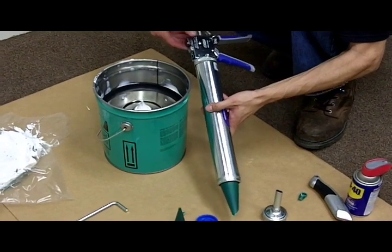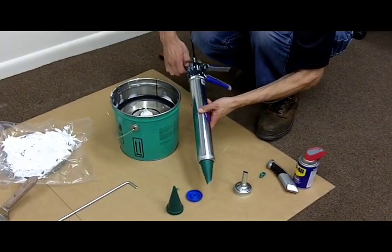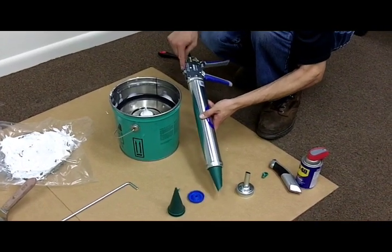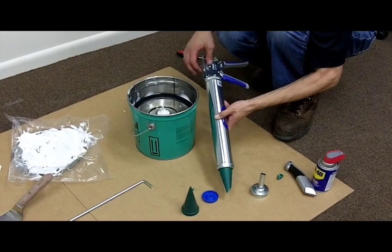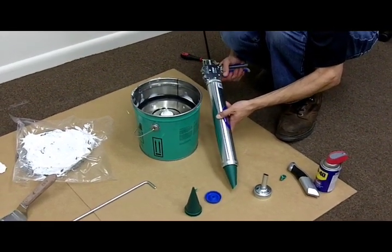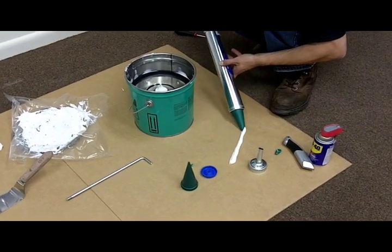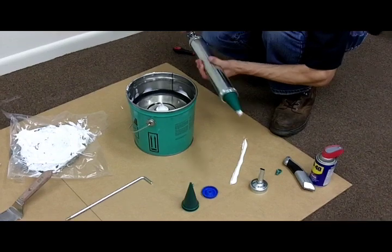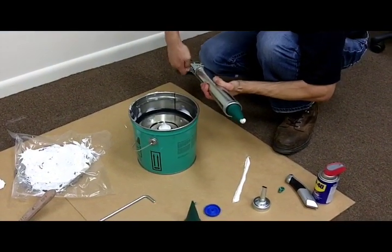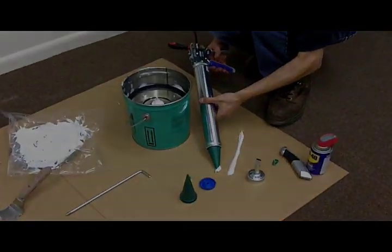And again, on the 600 series, we have this adjusted stroke. I'll show you something real quick. I spun it around so that the larger portion is hitting the top of the friction plate here, facing forward. That's going to give me about a 7-to-1 thrust ratio. Just out like that. And if I spin it around, I'll get a 14-to-1 thrust ratio.